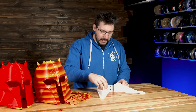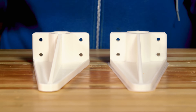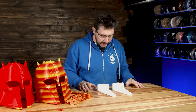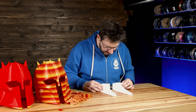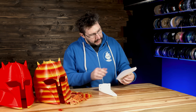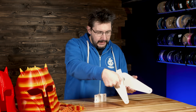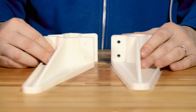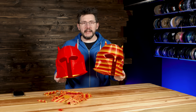Last but not least, the bracket — which is more in line with what a Raise3D customer might be printing: brackets, jigs, and very useful practical things. The high speed looks fantastic and dimensionally it is the same. I did experience some lift on the slow speed, but with the brim, the high speed did not detach from the bed. The real test for me was the helmets, and I think it did a really good job.